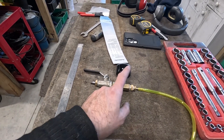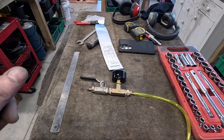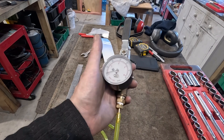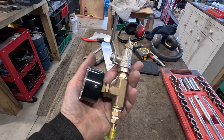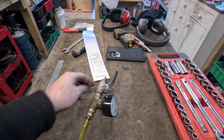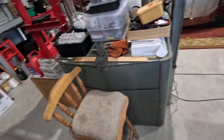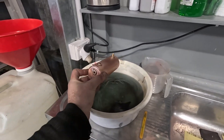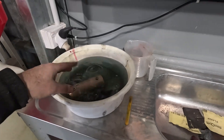I've used the brass fittings - the steam engine just has little threaded bosses, quarter 26 BSF. I've got a few BSF bolts so I can block those off. This little pressure gauge goes up to 60 psi, which is probably what I'll test the boiler to - 50 or 60. Running pressure will only be 15-20 psi. It has a Schrader valve on the end so I can pump it up and shut it off to hold the pressure. You do that with the boiler full of water - it's a hydrostatic test, you don't do it with compressed air. The boiler is probably the hardest part to make because it takes silver soldering and you have to get that right.